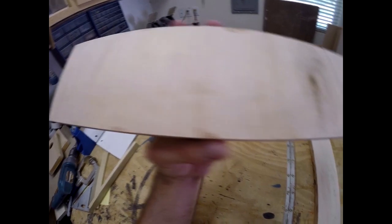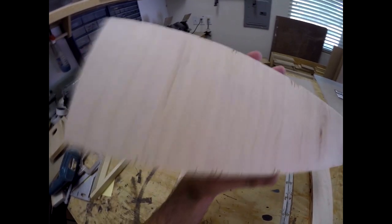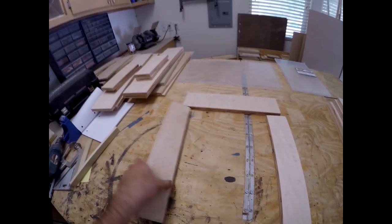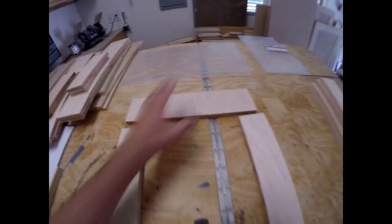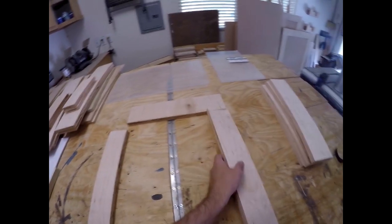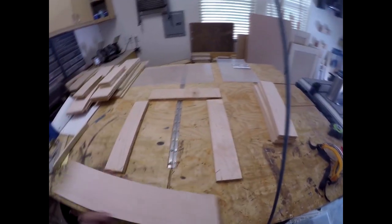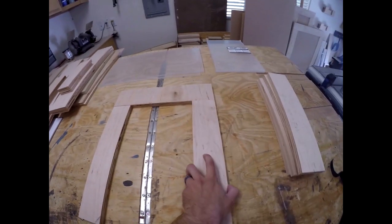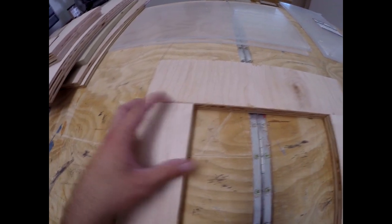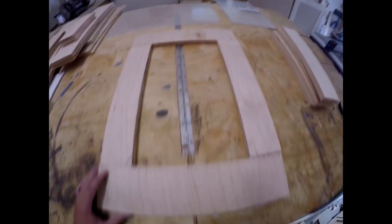The reason you want to do this is, if you're putting pocket holes, you want to choose the side that's worse. That's a good example - that's tear out. I wasn't able to clean it up from when I bought it from Lowe's because their blade was horrible. So this will be the back side. Knowing that, I'll flip this one over and flip all these pieces, and I'll find the better side on each.